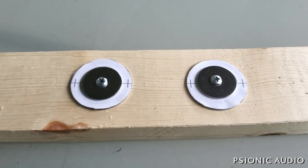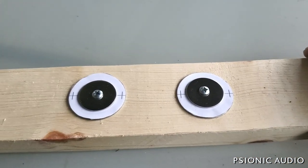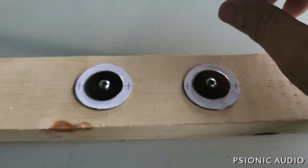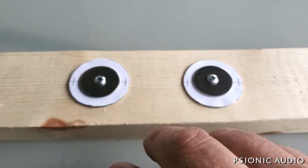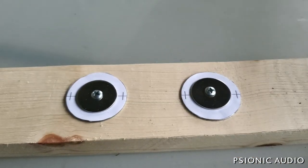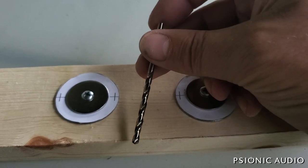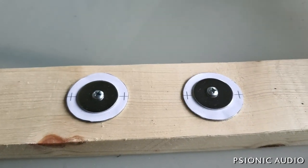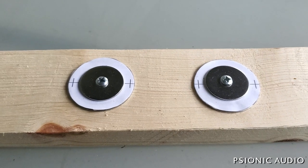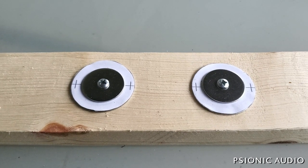All right, so scrap lumber — thanks to Norm Abrams — and a smaller washer and screw, and all of a sudden these won't move, and I've got a large piece. Now, I can position the bit by eye. I'm going to start with a very small bit, then go up to an eighth, and then the final 9/64ths for a number six screw. Then I will use my deburring bit, which is just a countersink bit, to take off any rough edges on front and back, and then it'll be good to go.